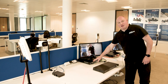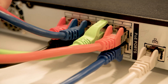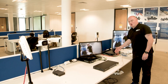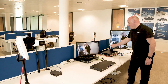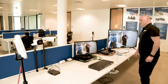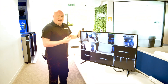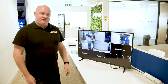This is my 5 Series 5-megapixel active deterrent camera connected to my network video recorder via the green cable on the PoE port. Since this NVR is now acting as a pure switch, you can see that I'm recording that same camera feed on this network video recorder and another network video recorder simultaneously — that's why we have two identical displays. That is an excellent disaster recovery feature, and we can utilize it by using Bridge Mode. There's no delay on the Wi-Fi bridge either.